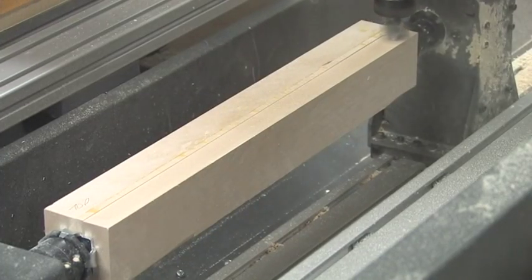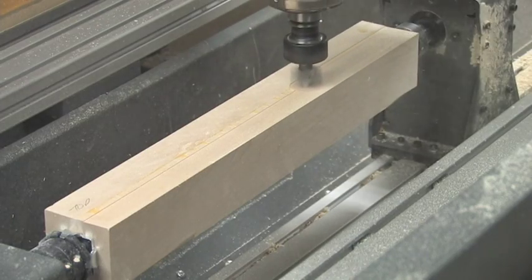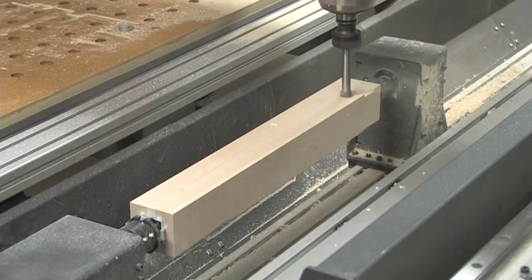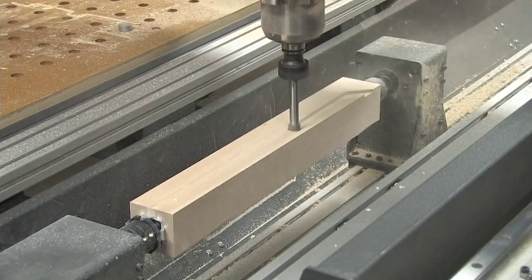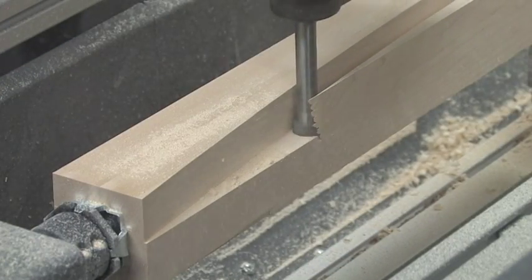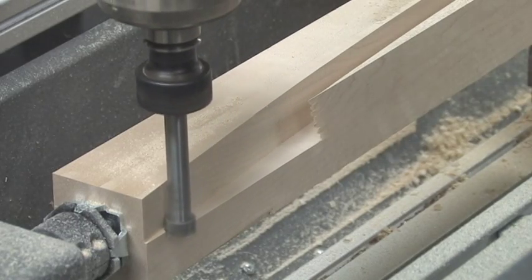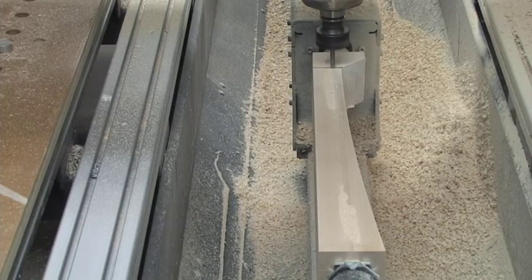To form the corner post, we mounted the stock between centers and surfaced two adjacent sides to ensure that the parts would be square and perfectly dimensioned. Next, we used a pattern cutting router bit to cut the curves on the opposite sides. Legacy designed this cutter, available from Magnate, with a long shaft and a bearing that supports the cutter as you make multiple passes cutting on the side of the stock. However, for this project, we removed the bearing from the cutter.